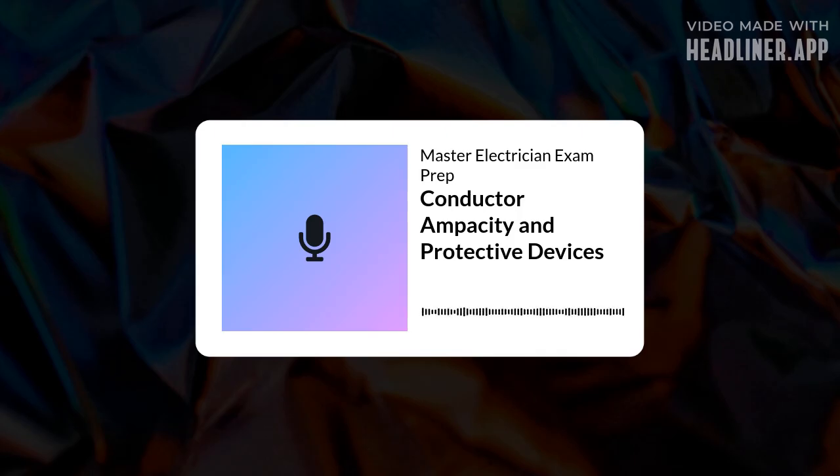Right. Different reasons there, mostly about secure termination. So these physical rules aren't arbitrary. They tie into reliability and installation practice. That makes sense. And you mentioned types of conductors earlier. The NEC breaks them down by their covering. It does. You've got bare conductors, like some grounding conductors, no covering at all. Okay. Then covered conductors. You have a material covering, but it's not rated as NEC insulation, maybe just for physical protection or specific uses. And then the standard? Insulated conductors. These have a covering that the NEC specifically recognizes as insulation, providing that electrical protection. Got it. Bare, covered, insulated.